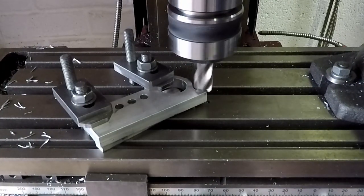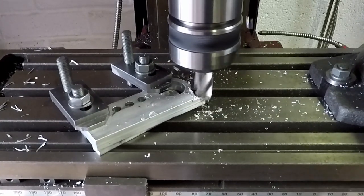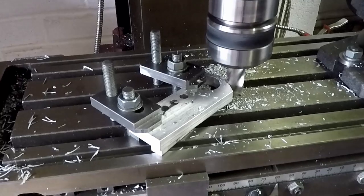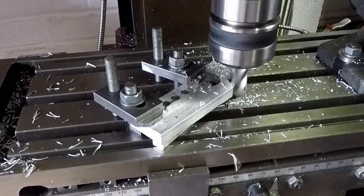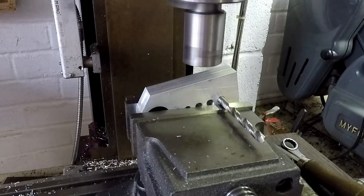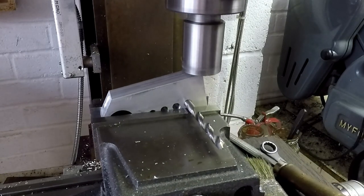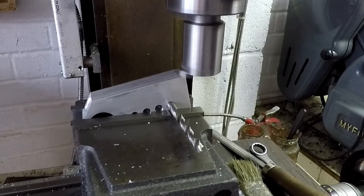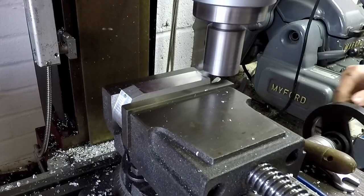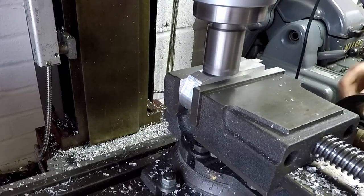Just need to chew away that little nubbin on the end of the workpiece, again using an end mill. You can take light plunge cuts using an end mill as long as you're not using the whole diameter. And again the final cut is using a climbing cut to give a nice finish on the workpiece. Here I'm using my fly cutter to take away the angled piece on the side of the workpiece — I have to advance the cut very slightly each time. I've repositioned the work in the vise here just to hold it more securely as I take the final cuts.